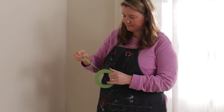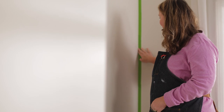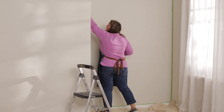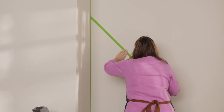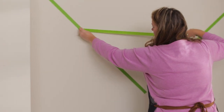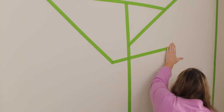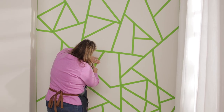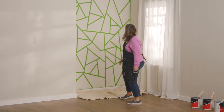Start taping! Use your painter's tape and put a design on the wall. For this project, I recommend FrogTape. It's made with an exclusive paint block technology — a super absorbent polymer that reacts with the water in latex paint and instantly gels into a micro barrier that seals the edges of the tape to prevent tape bleed. This will give you the cleanest, sharpest lines.